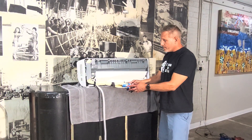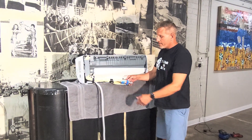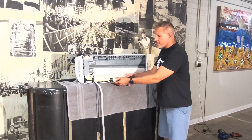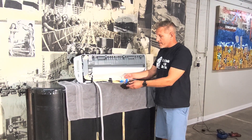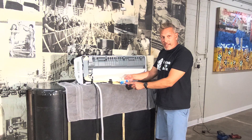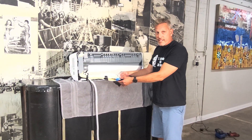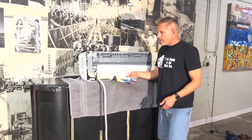Also, this blue tape — we're going to take that off later. This black tape, keep on. And keep these plastic covers on because all of this is eventually going through that two-and-a-half-inch hole. You don't want any drywall dust getting in these quick connectors, so those covers need to stay on. This blue tape is temporary — it's going to help you get it through easily.